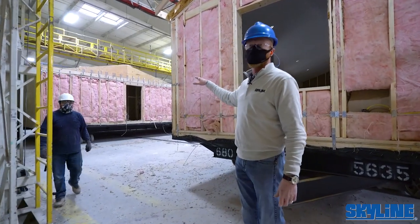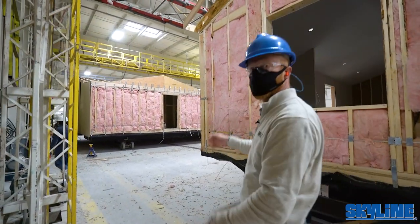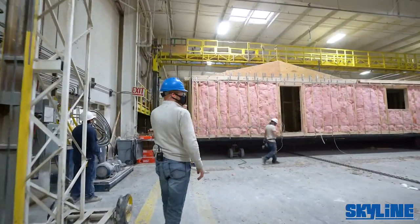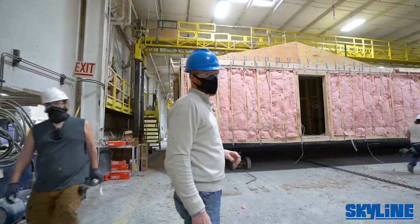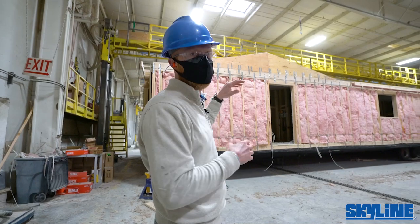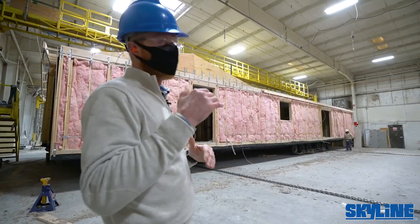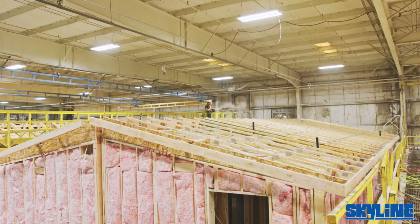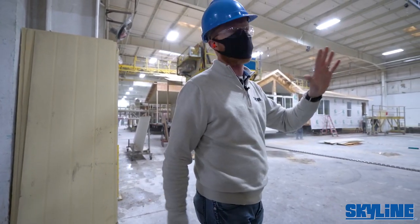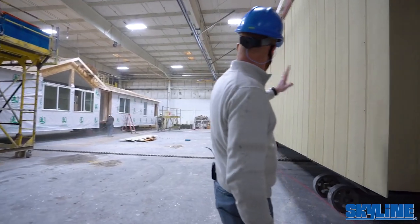Right now they're rolling the production line — you can hear the bells as sections move and make room for the next ones. Getting closer to where they'll start decking the roof after blowing in cellulose insulation. The R-value the customer has chosen dictates how deep the insulation is in the roof cavity. Now the siders are working on the exterior cement siding — James Hardie siding — with sheets of cement siding panels running all the way down.